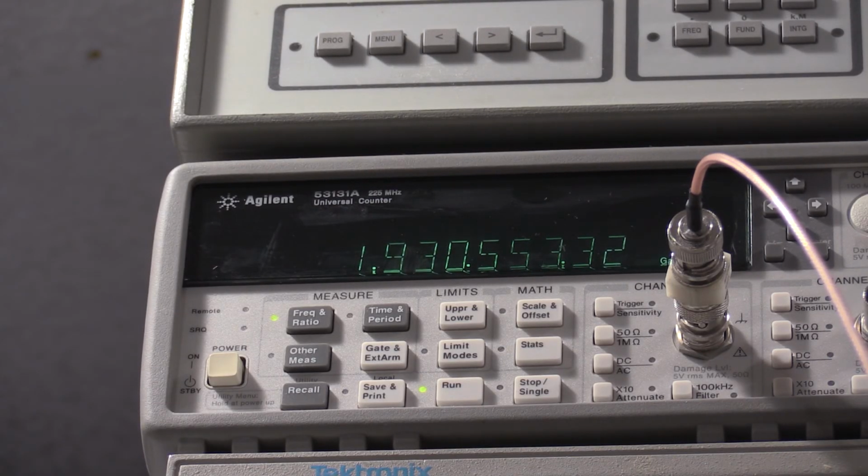We've pushed the manual trigger button. And so now I need to adjust the scale factor, which is R1620, which is right next to R1622. But I need to adjust this for 2. So we're pretty close. Well, I'm not going to argue with that.